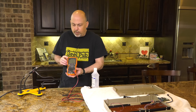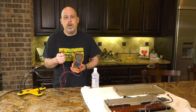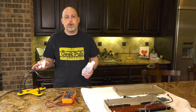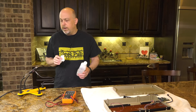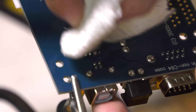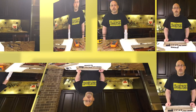After you solder something like this, especially as an amateur, get a regular meter in continuity mode and make sure none of those pins are connected to each other, because they should all be independent. There can also be flux left over on the solder pads that can make an unintended electrical connection. The best thing to do before re-soldering or anything else is to get a paper towel and some isopropyl alcohol and wipe off all of the contacts you just soldered and the surrounding area, then re-check. You should really do that any time you solder to clean off excess flux.